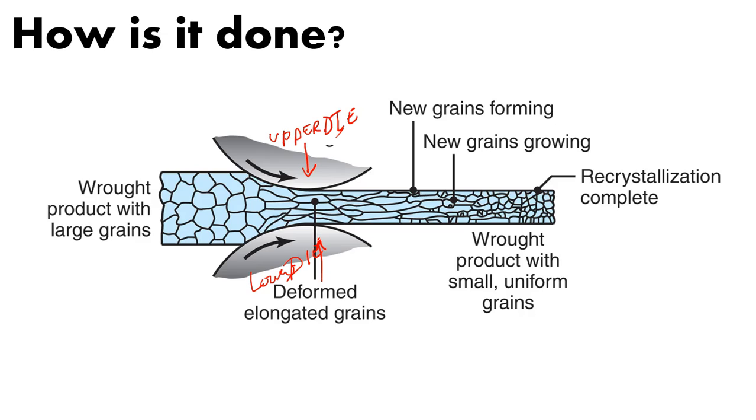You're also going to get rid of a lot of the porosity inside of that metal as you go through the forging process. So you get smaller grain sizes and less porosity, but something else also happens — you actually start to align your grains. You get an aligned grain flow, which is a really important part of the process. You're actually changing the structure and the mechanical properties of the metal because of that new grain flow, making it much stronger, much more ductile, and much less likely to fail due to fatigue.